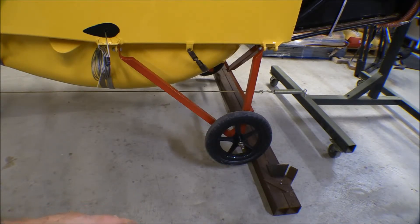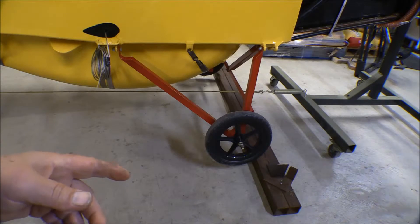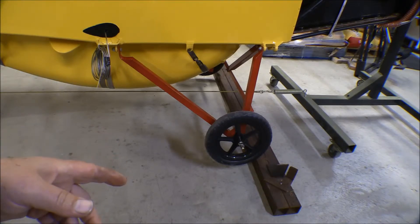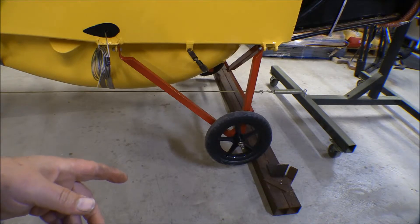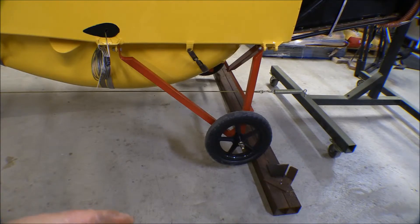The framework probably will hold up, so I've dug out some box tubing — scrap stuff we salvaged out of a junk pile that had been the bleachers in the gymnasium they rebuilt. This piece happens to be doubled up, two pieces welded together, and it's thin-walled — 3/32nds. The stuff's been outside, it's rusty inside, not very nice to use, but I'm going to use it for a base and it'll be a nice solid base. It won't be tippy.